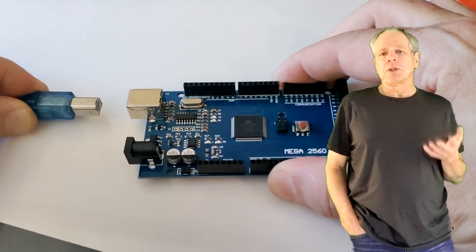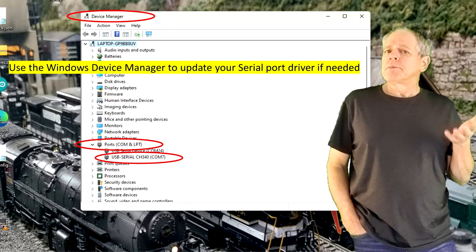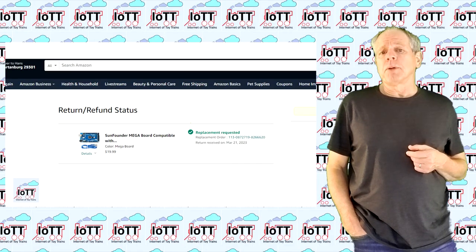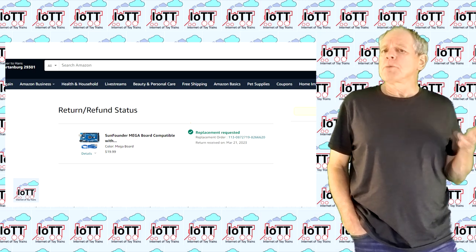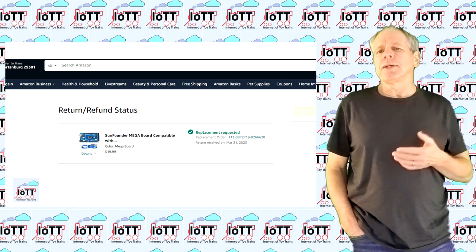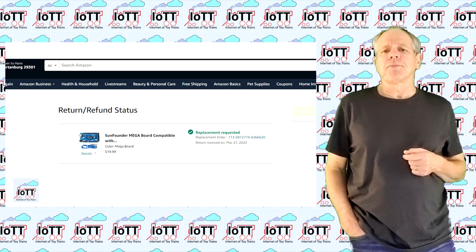If you don't hear the notification, you may need to update the driver or possibly the hardware is not working. I recently had this problem with a Sunfounder Arduino Mega I bought from Amazon, which apparently had a dead USB port. I simply returned it and got a properly working replacement within a few days.